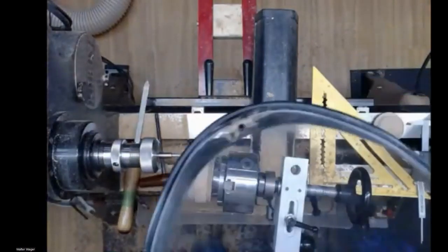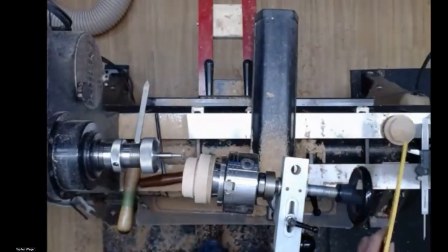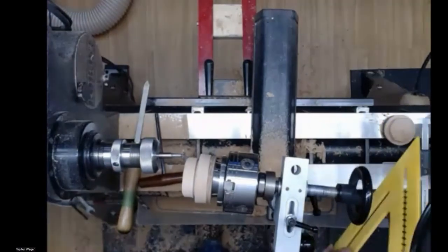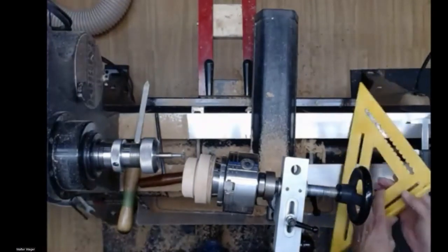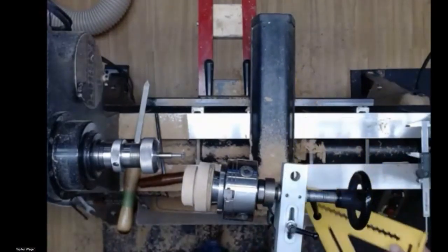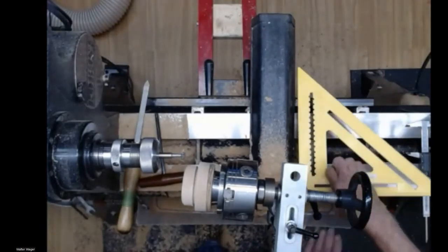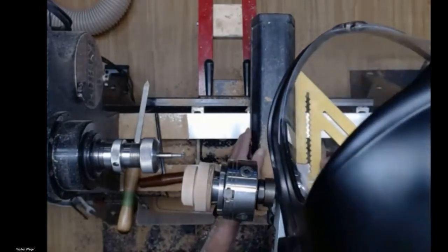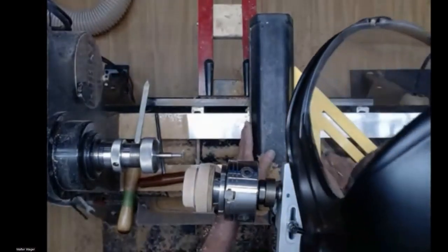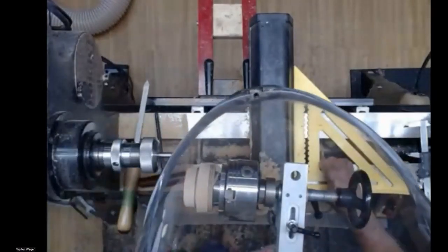All right. So I'm gonna square up the banjo, and then I'm gonna do a sight squaring on the tool. I say you don't need but a speck of dust or dirt between the surfaces of a square and something else, and you won't be able to get it square. That looks pretty good in my setup here. Let's see.